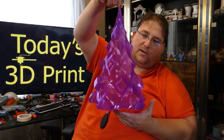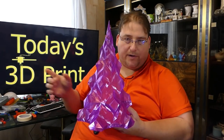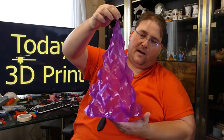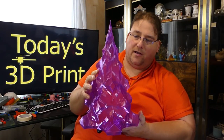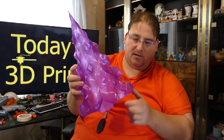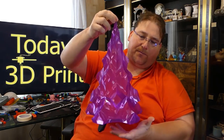One consequence of these things — I had like four failures printing the really pretty one I'm going to show you last. You've got to print slow. I got lucky the first few, but as soon as I tried printing slightly faster, it would break down at the base and wouldn't connect properly. So you've got to print these things slow. It takes 12 hours 9 minutes, but I believe I can get that down to 10 if I drop the bottom.